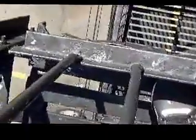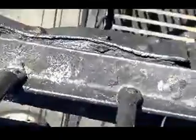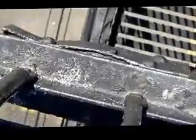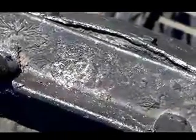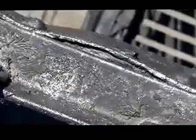And we have a couple issues here. First issue is where this bracket meets, there's a gusset plate. And I will just try to zoom in on this. I might have to come on this side of the rail. And actually it's blocking it. Let me come this way. Oh, you can see it there. You can see to the upper edge of the picture that is completely bulging. It's rusting. It's rust jacking. It's putting the whole member in distress. So that is very suspect.